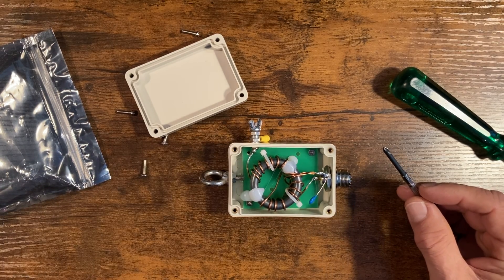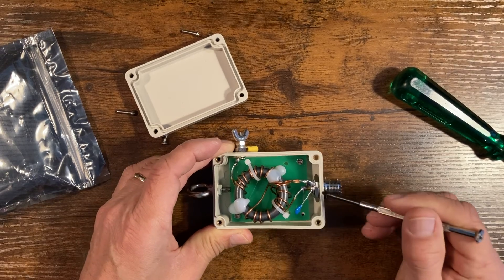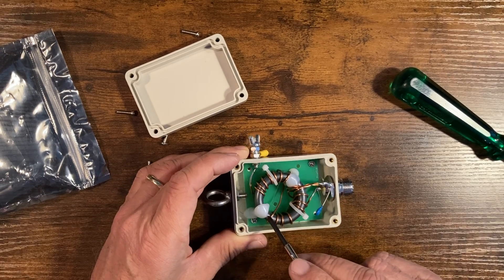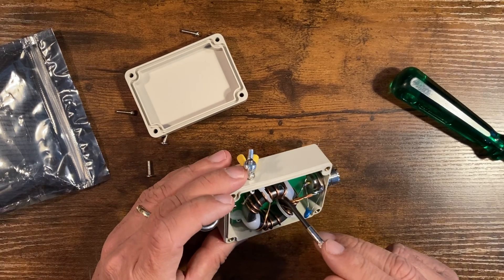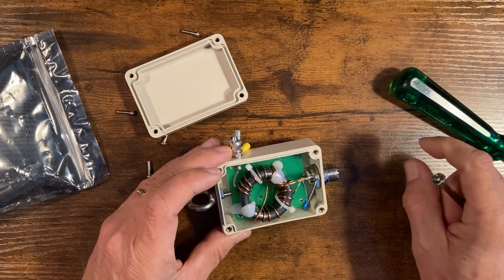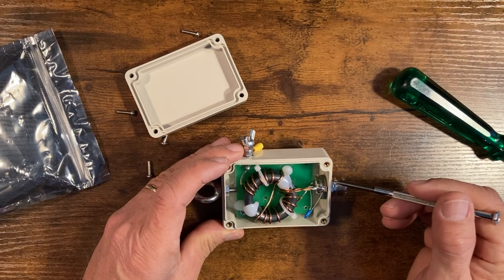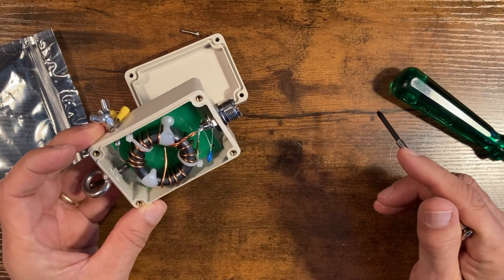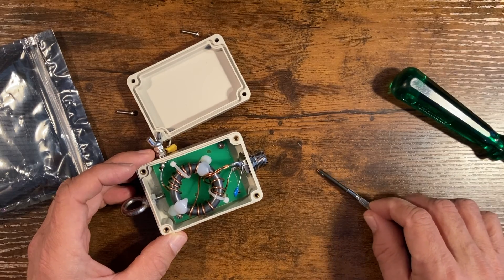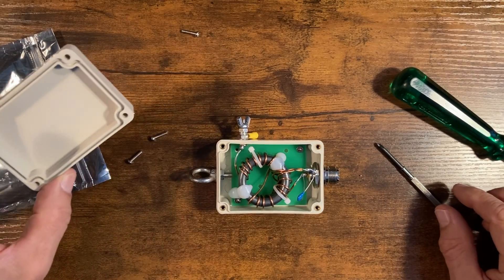The construction looks fine. I don't see any cold solder joints. The soldering seems pretty well made — a little bit of bubbling there but nothing bad. The components are well fitted, another good solder joint here, and the toroid looks of decent construction. There's a little bit of silicone we can get rid of. I did notice something wiggling around — it was a loose solder ball inside, but just take that out. For the price, this seems to be a very good assembly.